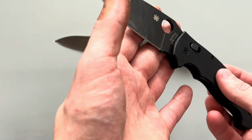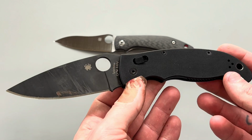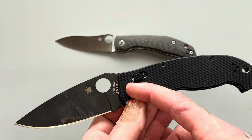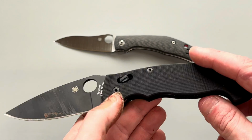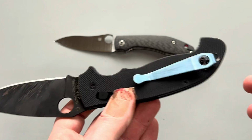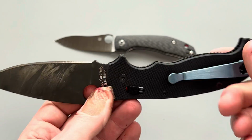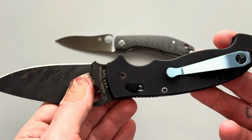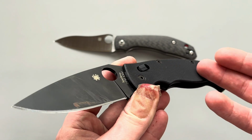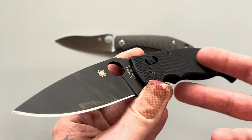Moving on, for the hardware, we get a 5 out of 5. Spyderco uses the same hardware sizes on 99.9% of their knives. You have a T10 pivot screw, T8 for the scale screws or handle screws, and you have 3 T6s for the clip. You know, I'm not a big fan of T6s, but I have yet to ruin a set of Spyderco screws, as long as you have good Torx drivers like the Wiha Soft Touch, which I always recommend, always linked in the description, you're not going to have an issue.